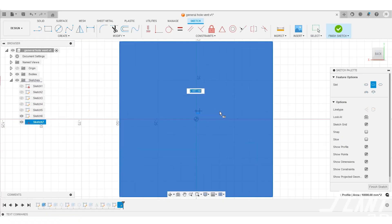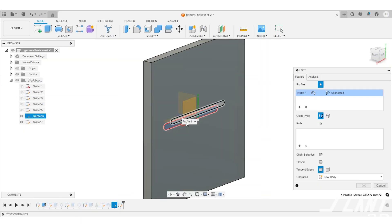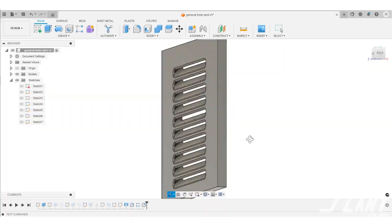A much better option is to still use slots but make the minor modification of cutting them through the plate at an angle. By doing this, you increase the cross-sectional area, so you avoid the breakage issue, and you can get much longer slots with much less support. Some support is still necessary, but you can address that by putting small support ribs along the slot so that you maintain the minimum bridging distance. This support is very easy to remove because it has much less surface contact and can almost be popped off. These angled slots also have the side benefit of blocking light pass-through — useful if you have RGB lighting and don't want it shining through the fan shroud.